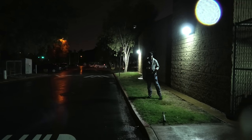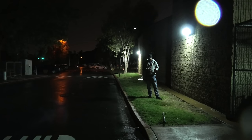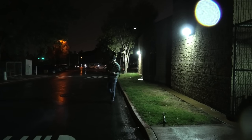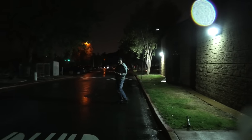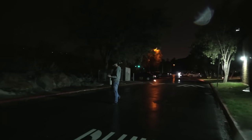We wanted to show how the light changes as we move away from this wall pack. Right next to it on the ground we saw about 5 foot candles, but at waist height closer to the fixture we're looking at about 10 foot candles. Moving out, it drops significantly — about 3 foot candles, then 2, then 1 — and as we get to the other side of the road we're down to about 0.5 foot candles. So we are getting some light out there, but not what you'd want for full coverage.